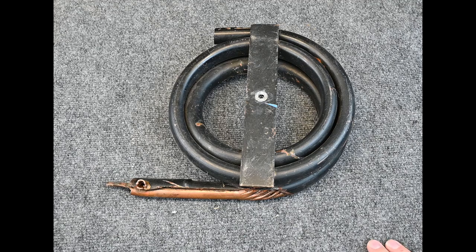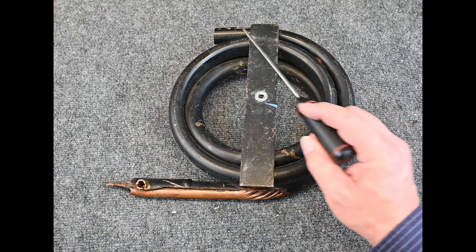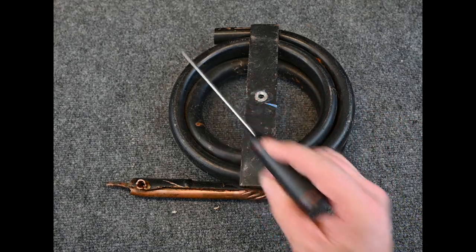Now we discussed this water-cooled heat exchanger, a lot more detail on the condenser side, but we can also use this very same coil to transfer heat on the evaporator side. In other words, I could run refrigerant through here at a low pressure saturated mixture. That refrigerant's running on the outside as it circles through, that refrigerant's boiling, changing state from a liquid to a vapor. Then we pull our vapor back on the other side, back to the compressor.